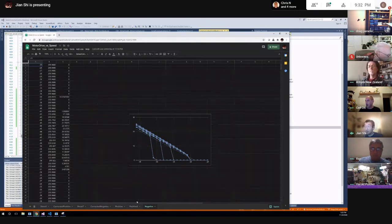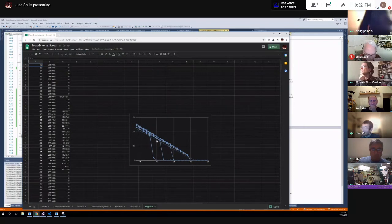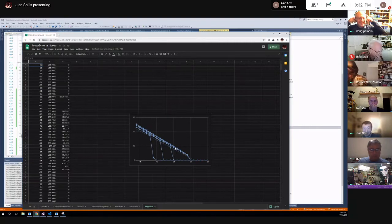I worked around it, and I can show you guys. Basically, what I did is I linearized this. I can map the drive by eliminating the center dead zone. And then to remove the hysteresis, when it's changing direction or going from stop to go, I kick it with a high drive. Then I look at the encoder, say five counts, and after five counts, I say, okay, it is moving, and I switch to my expected drive. But I don't know, is this the right way?